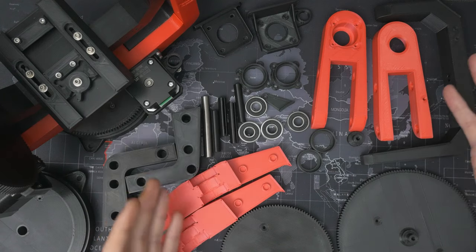You'll notice that there's no captive nuts or heat inserts on this - it's basically screwing straight into the plastic, which isn't ideal, but this one's held really well. This lack of captive nuts or heat inserts is pretty consistent throughout the entire build. Most of them you're basically just threading into the plastic. It holds pretty well but it does mean that you're not going to want to keep assembling and disassembling this, because eventually you will just wear the threads away. So once you've put it together, that's it - you're stuck with it.